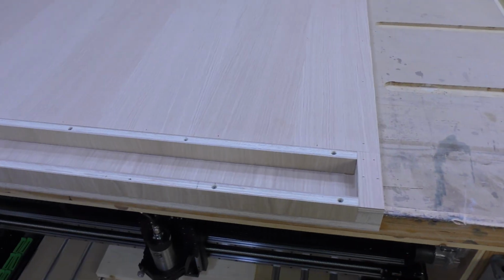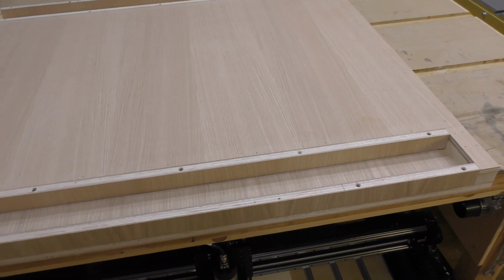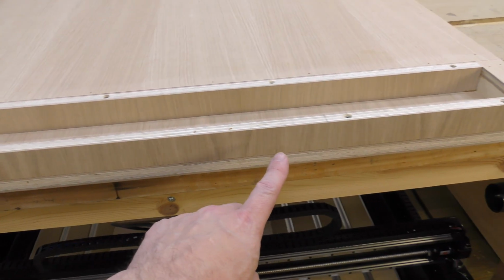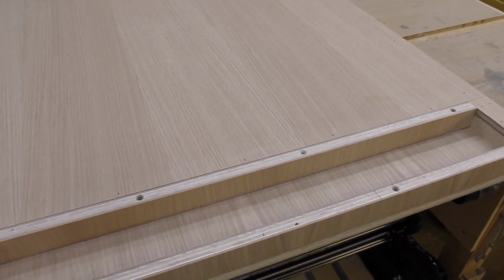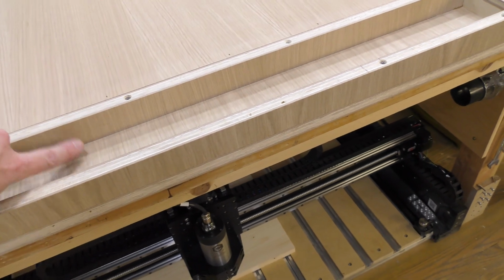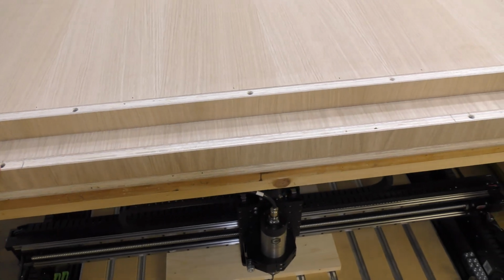And now I'm going to show you the bottom. Same rib design as the top. However, this is upside down. This is the underside that'll never be seen. But because the bottom shelf of this table is going to have an archway routed out through here, an elongated archway, this will be a little see-through, and I didn't want to show the undersides of the table. So I created this little notch nook there, that if you were to be able to see through it, you would just see the oak veneered plywood in the background, so it would look the same, just in case.